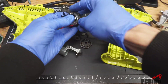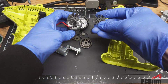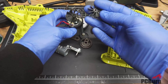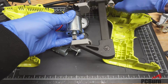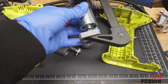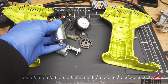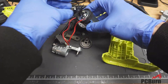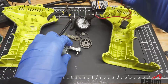The fan I made for it on the 3D printer — I'll make the model available — I oversized it a bit from the original and had to flip the way the fan blades were running, because this is actually the reverse of what I needed looking at the original fan that was on there. So I'm just going to press fit that on quick with my vise. Done. All set there. That should provide adequate cooling for this thing again. And then reassemble.